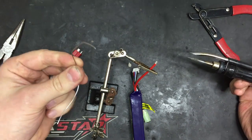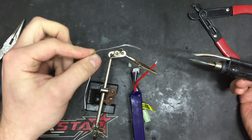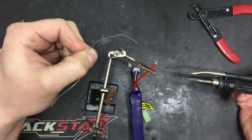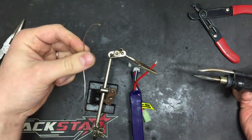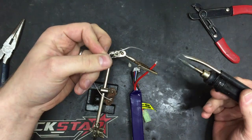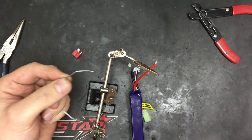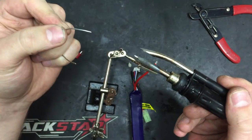The solder I'm using is silver eutectic lead solder - it's about 62% tin, 36% lead, and 2% silver. This means it wets and sets much more evenly and much faster than regular 60-40 lead solder, and it gives you a much stronger and shinier join. It's really easy stuff to work with, and I can highly recommend it over lead-free solder or even standard lead solder.